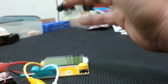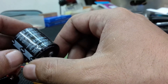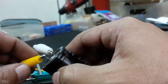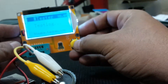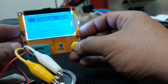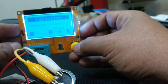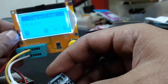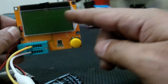Let's go to a bigger capacitor — a 4700 microfarad cap. I doubt it holds its rated voltage since it's been in the bin for years and the charge may have dissipated. It reads 5015 microfarads, which is quite far off from the label — probably due to age. The ESR is quite low, which is good.